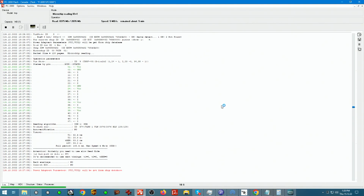The NAND is the box, technically, and inside of that box we have chips, and those chips are bits of data that are all tossed around and mixed up, and they need to be properly organized and assembled in a specific sequence, like the puzzle maker had intended, in order for us to see the picture. We're not going to see any files until the logical image is built. Now the logical image is going to be built, but first we need to determine what the function of the controller consists of.